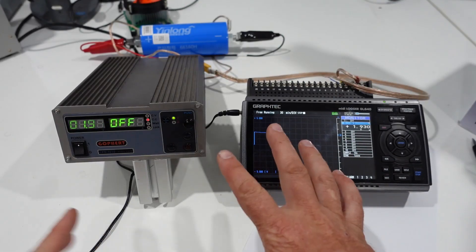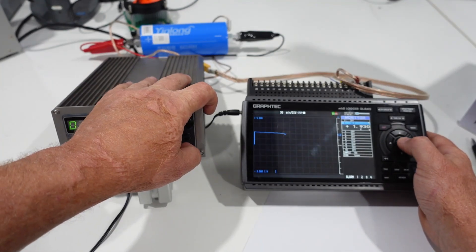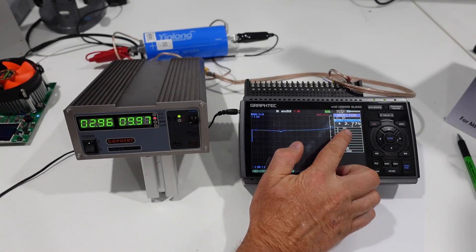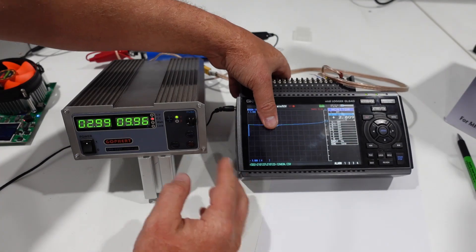This is all set up for charge now. We'll start the recording and power supply at the same time. Coming up to 2.8 volts — there we go. That was our benchmark test: we put 42.25 amp hours into the cell when we charged it, which is 95.5 watt hours. When discharged it released 41.92 amp hours which was 92.72 watt hours. That's a coulombic efficiency of 99 percent and an actual power efficiency of 97 percent — about two percent difference between coulombic efficiency and actual efficiency at that temperature.